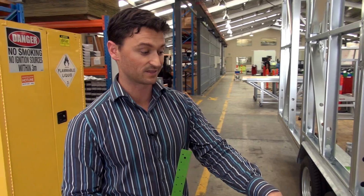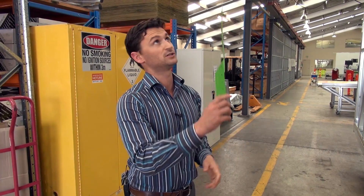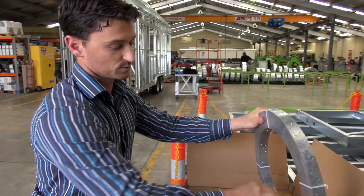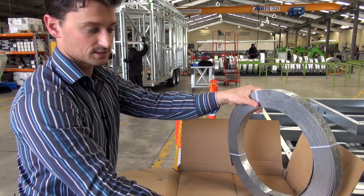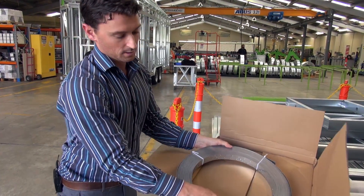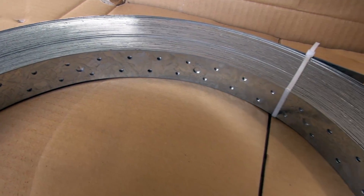We're not sure where we're going to be parking the house, so we can't design it for medium or high winds — we have to cater for every environment. In particular, connecting the studs down to the perimeter channel of the trailer is where we're using these now, and later we'll put a few over onto the roof panels. For areas where we want to strap the roof and don't have a standard bracket, we'll do it over the ridge using standard 32mm 0.95 gauge strapping with pre-punched holes for our standard FrameCAD tech screws.